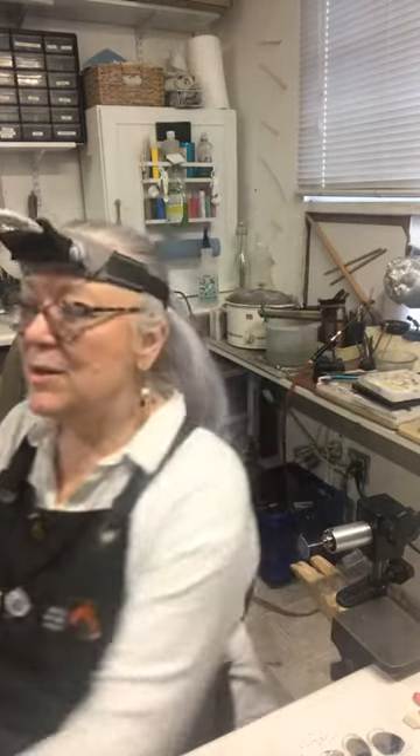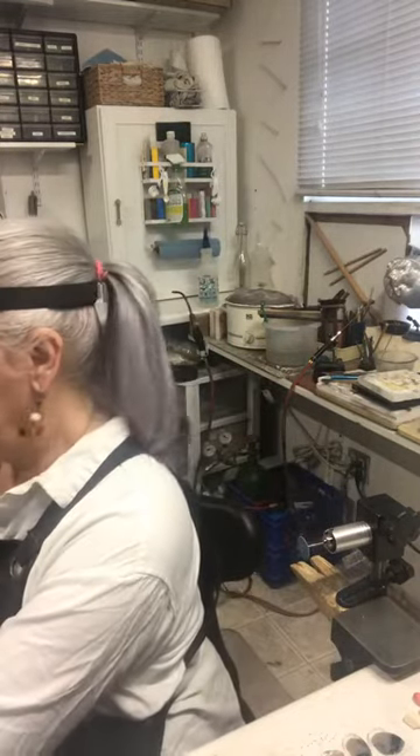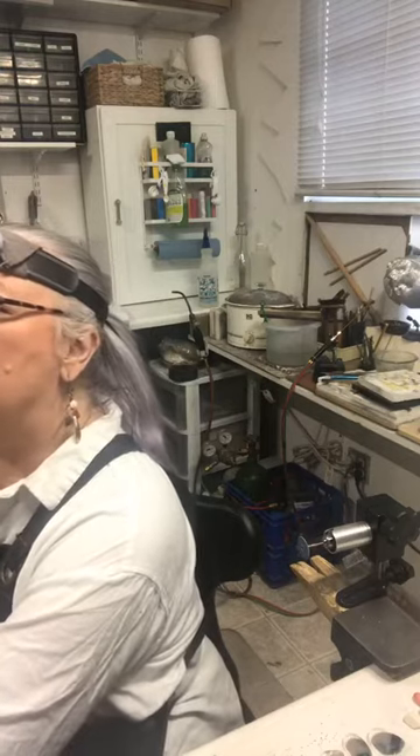Julia's going to be doing the Etch in a Bag, which is like a 20-minute, very low-tech etching class you can do at home with really simple materials to get a really beautiful plate for running through the rolling mill or just to get a really cool etch on brass and copper. We've also got Alternative Stone Setting: Prongs and Pedestals coming up on Thursday — great for all kinds of miscellaneous shapes and sizes of stones, found objects, or enamels.